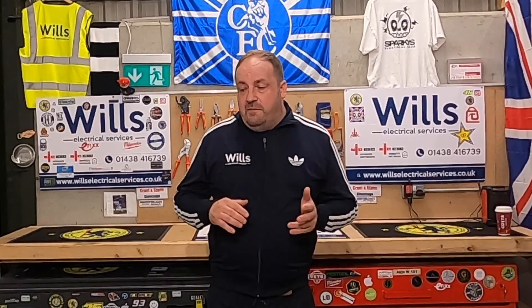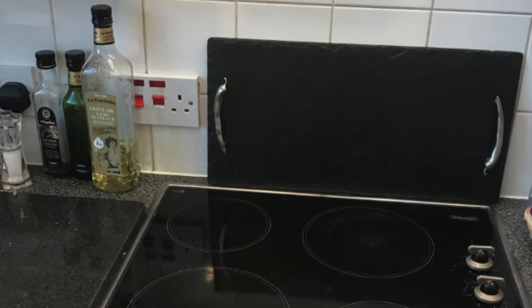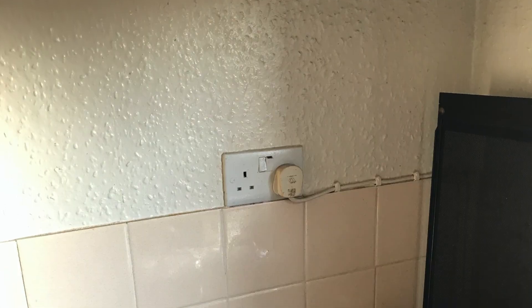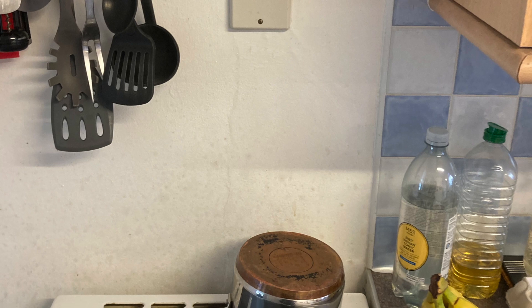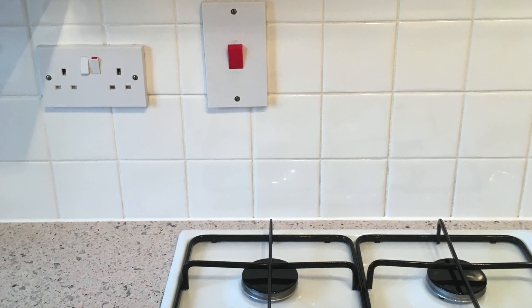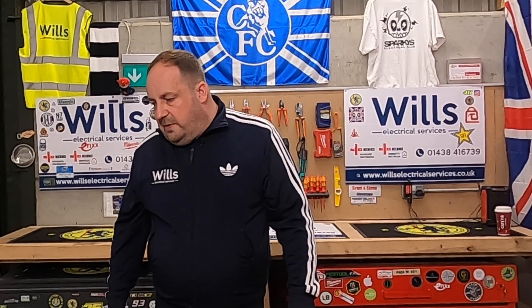In the kitchens, I look for the position of power and lighting accessories towards the hob and oven — whether they're within 300mm. It's a tough one really, because we all know how it is: we wire the kitchen then the kitchen fitter decides to fit it a different way, and you see all the accessories behind units. If there's thermal damage then it's a bigger issue; if there isn't, it's debatable.